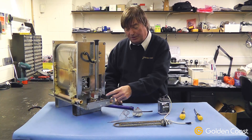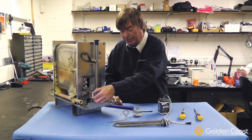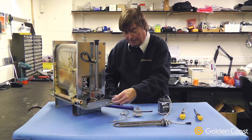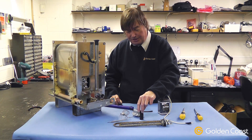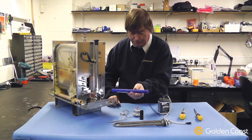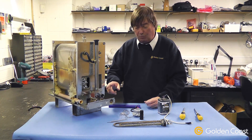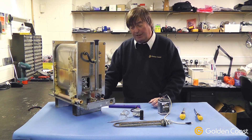Another problem to watch out for is the drain plug, which can be removed quite simply by pulling the rubber plug out. This rubber plug seats back against the seat in the drain, and if that seat is dirty you'll get constant boiling water flowing down the drain and difficulty maintaining the steam level in the steam room.